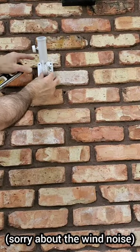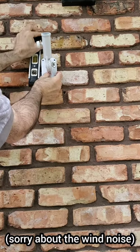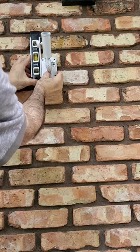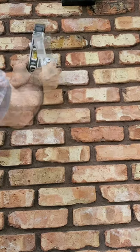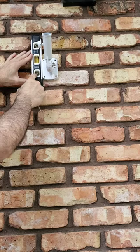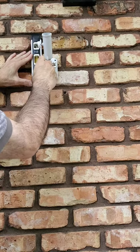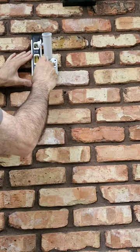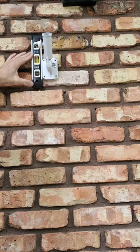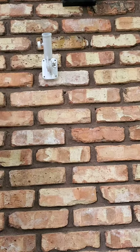I'm lining this up with the screw hole and marking it, then flipping around to use my level. I put that one screw in so I can figure out the proper level, looking at my level — basically pretty good right where it is. I scratch the brick a little bit so when I take it off I can find the hole. I get these two in first so I know it's level, and then drill the other holes just by marking them.